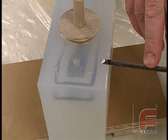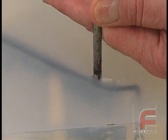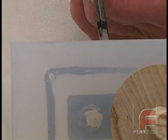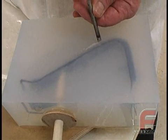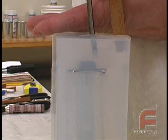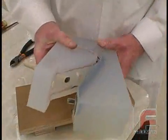Now it is time to cut our parting line. We mark the edge of our gouge with a marker to help us avoid cutting too deeply. Then, following our parting line, we begin to cut the silicone rubber. Note that we aren't trying to cut all the way to the tape with our first pass, but rather we are planning on taking two passes with the gouge. This conservative approach not only makes it easier to cut, but it also establishes a more complex registration that will ensure proper alignment of the two mold halves later. Our first pass simply establishes the outside of our parting line. With the second pass, we place a wedge in this established parting line, which makes it easier to access and then cut the remaining rubber all the way to our clear tape. After the second pass, there are a few remaining small sections of rubber not completely cut through, and therefore keeping the two halves together. With a brief final pass with our gouge, our mold comes apart.